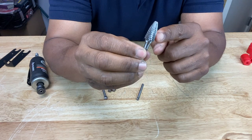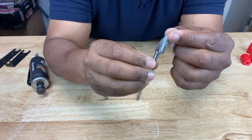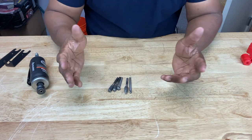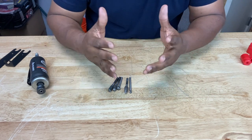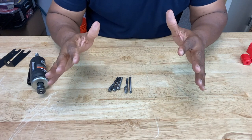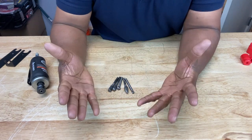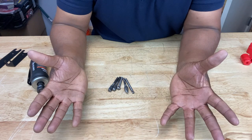Then you have a cone shaped burr with a round head on the tip, versus a cone shaped burr with a pointed tip. You have a ball burr and a smaller ball burr. These are just a few examples of burrs you would install in your die grinder to remove material. They have other shapes out there — oval burrs, flame burrs, inverted cone burrs, all kinds of burrs.